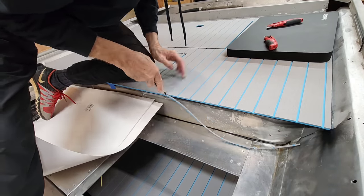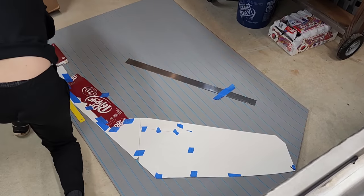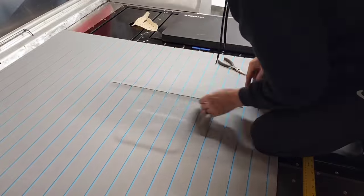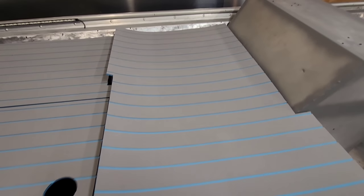For the boat decks, I'm using the light gray brushed HydroTurf with baby blue routered lines. It's the same material I used earlier in the video within the hatches. The key here is to get everything centered and symmetrical, but even with that, it started earlier in the build in the framing and decking stage, because here at the turf install, any imperfections will show if a hatch is off. You can't move the turf lines.